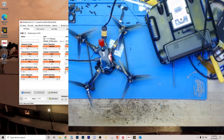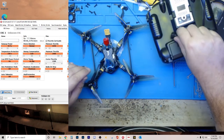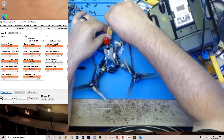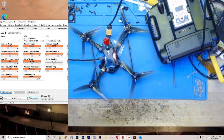So that's what I ran into, and it kept doing it over and over again. I was literally losing my mind. What I noticed — watch what happens if I unplug my transmitter. So there's no power going to the Ghost now. And if we do this... you've got to remember to disconnect the ESC before you unplug the quad. That's what that problem was.